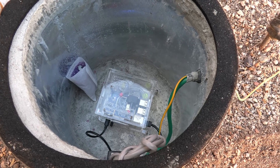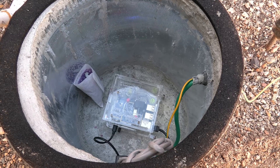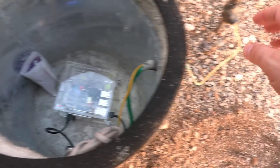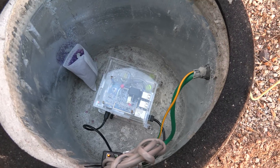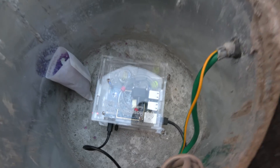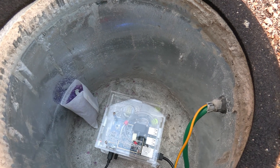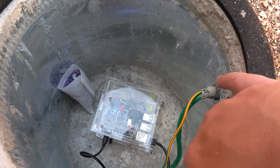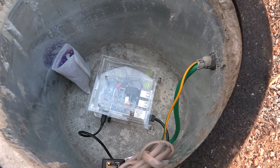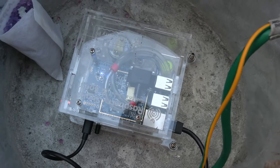This is the external housing I came up with for my Raspberry Shake & Boom — the model that has the infrasound sensor along with the vertical motion seismograph geophone. It's powered by PoE run out, and has a surge protector hooked up to a ground so that if there's a lightning strike nearby it doesn't fry my equipment. I've got some desiccant in there to help moderate the moisture content. I used metal flashing and a sonotube, filled the gap between those two things with concrete. This helps protect from RF signals that might interfere with the infrasound detector. It's sitting on a concrete pad and is extremely sensitive.